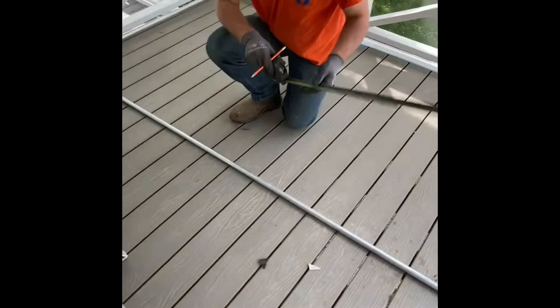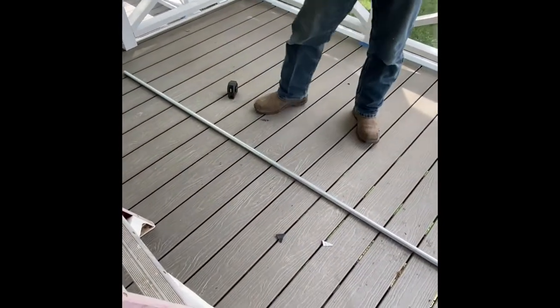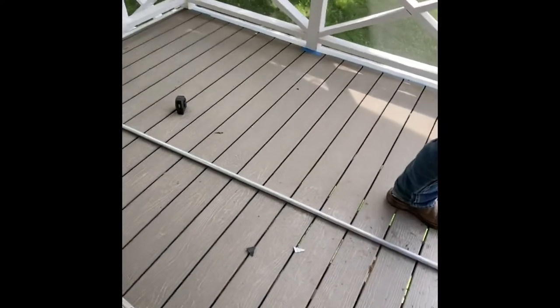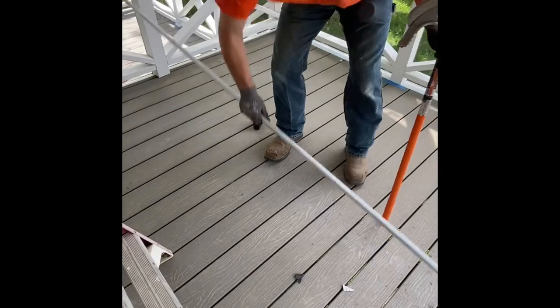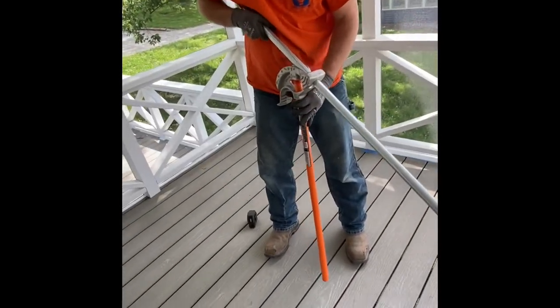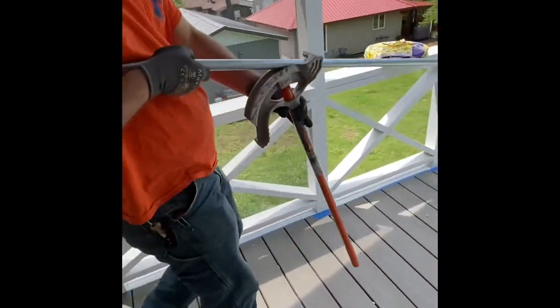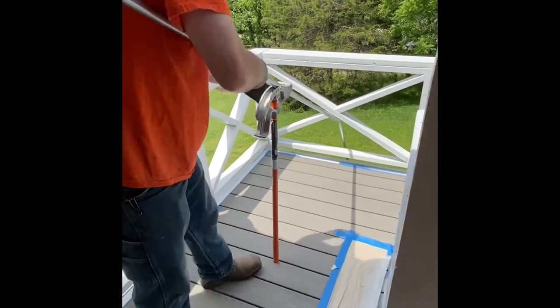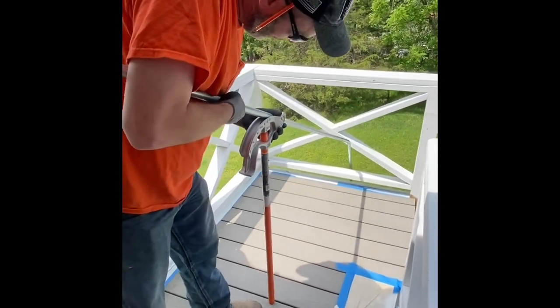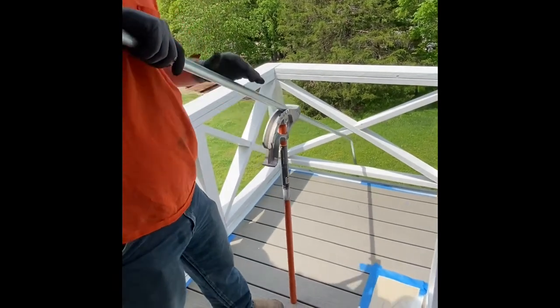From the center of that bend to the center of this bend is about 49 inches. We're going to bend another angle on there — same direction as the last one, otherwise you end up with an offset. It's actually going to be 60 degrees. Because we've got a long leg we'll let it overhang, and at that point we're going to put that mark on our star, because that's going to be the closest.